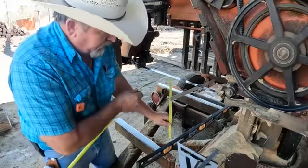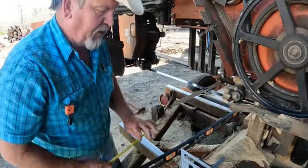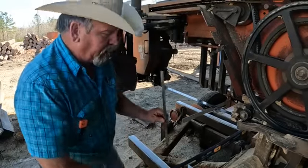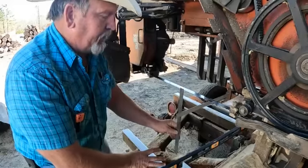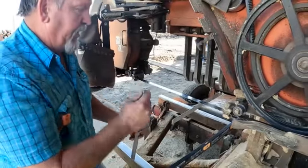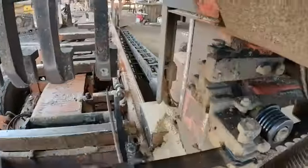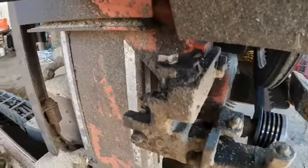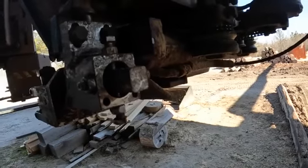A friend of mine recently shared a trick — it's probably not going to be quite as perfectly accurate because one bed rail might be a 30th of an inch higher or lower than the other. Over two and a half feet, the level laid across the top might have a little difference, but it's not going to be enough to matter in my opinion. So you measure up from there and then go to the back side and measure to the same point without moving the saw head. Another trick: some people are using speed squares — you get everything dialed in and figure out the height for that speed square and your ruler.